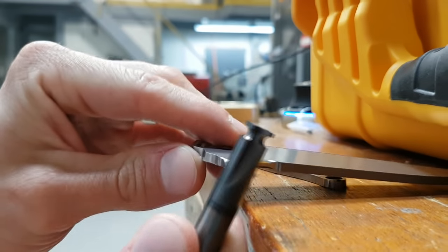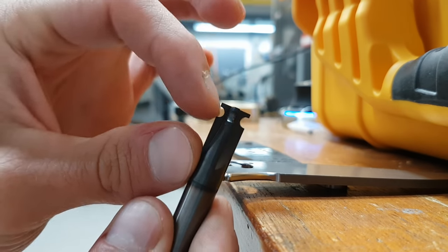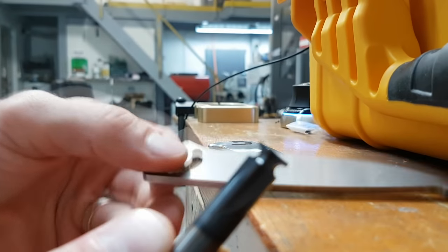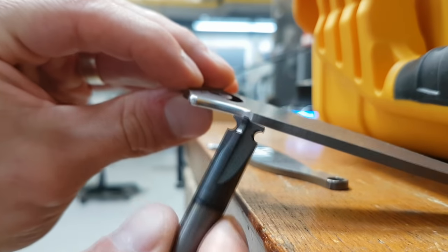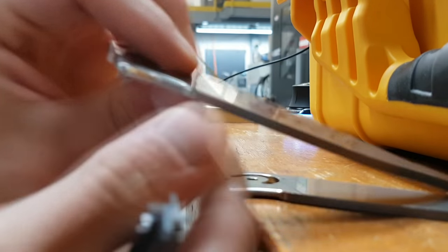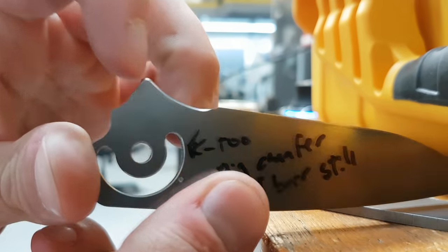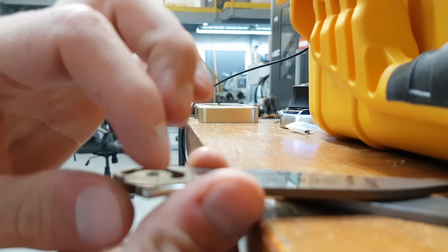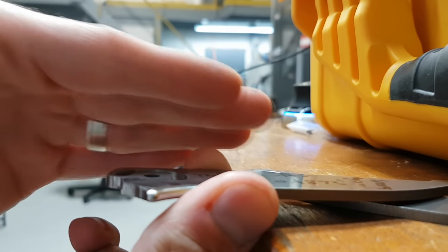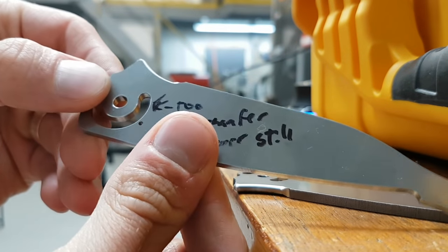I had Lakeshore Carbide make me a custom double corner rounder to exactly my specifications, with a little flare on the top and the bottom, so that it can do this full radius in one operation without having to flip the blade over like we were doing before. Less flips, the better. This is the only op that we actually have to get to both sides of the blade for. It works very well, but the tolerances are crazy tight. The first time I did it, it went way too deep — about eight and a half thou too deep. This side looks fine. If you use a one-sixteenth radius on eighth-inch-thick material, it's best to have it up a little bit because you don't actually need a full radius. You can often get away with a bigger radius tool than you want, and it's a bit safer.